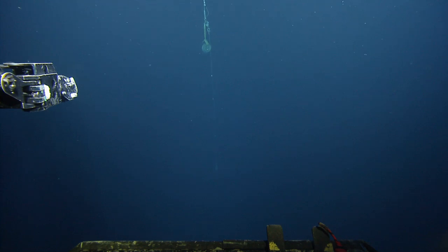60 meters. 60 meters off, yeah. So we want to look at the hook, keep the headache ball slash weights well above you. We're in the pocket as far as being on target on the seafloor XY. So, all right, we can keep going down 10 meters a minute. Winch control, payout 10 meters per minute continuous. Five meters is a good distance from it to keep it lit up. Roger.